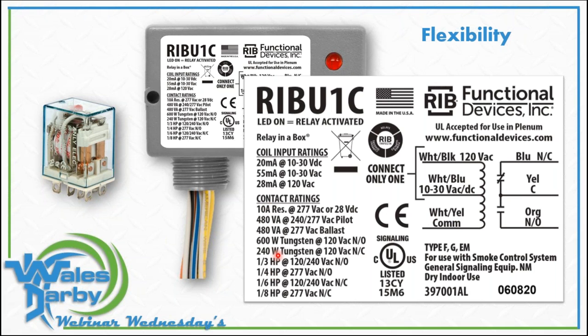The contacts have their own ratings. These relays are used for lighting — ballasts, tungsten bulbs, incandescent. Depending on what we're doing, maybe hooking up a motor, just check the amperage rating and we should be good as long as we fit within the ratings. I was working with a guy who didn't even need voltage to operate the coil — it was dry contacts driving those contacts closed on the other side. These things can be used pretty much everywhere, and with a light on them, you've got me.